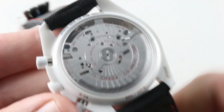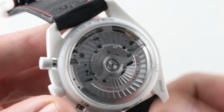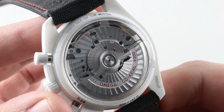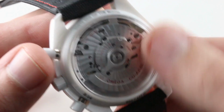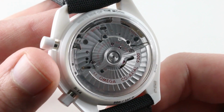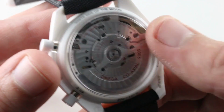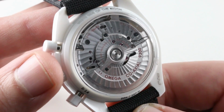Now there's more going on. Twin mainspring barrels in series. You can see them peeking out from underneath their barrel bridge. Those twin barrels endow the watch with a very even torque release for the entirety of its superb 60-hour power reserve. And that even torque release means the watch keeps good time when it's fully wound, it doesn't run fast, and it keeps good time when it's discharged. So it's almost empty, but it's still keeping good time because the torque from the twin barrels is very even. 60 hours, of course, far more than the automatic industry standard of 38 to 42.